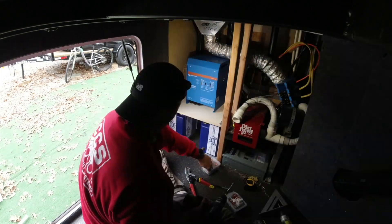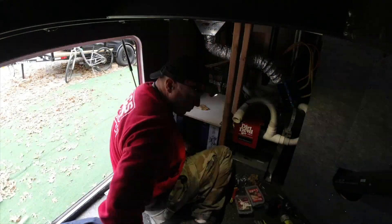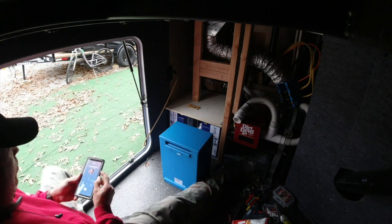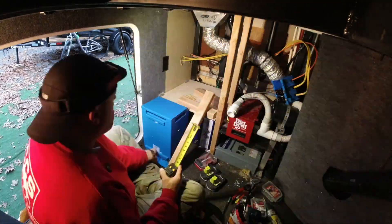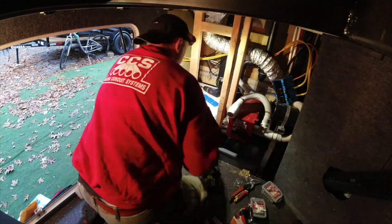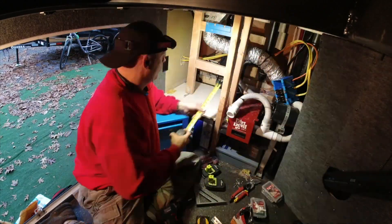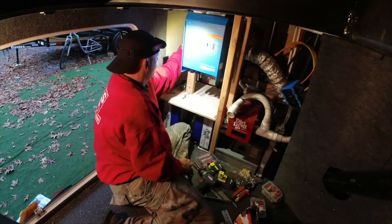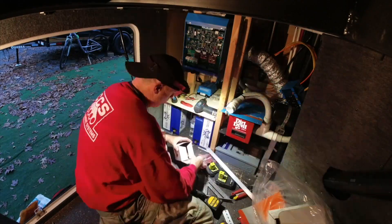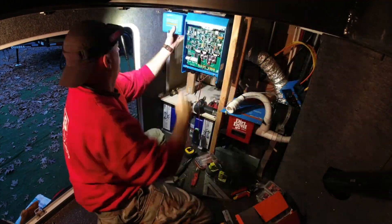Next, we're planning where the Multi-Plus will go. I wanted it mounted as high as I could get it so I would have room underneath to run a lot of the wiring. I recessed it in the space so it would come flush out to the front. A lot of the challenges with the Multi-Plus is that despite its size, it is 9 inches deep, 10 inches wide, and 14 inches tall - and that little thing weighs about 40 pounds. Whenever you're doing a build-out and putting one in, you've really got to make sure all your framing is very sturdy and secured on multiple points.